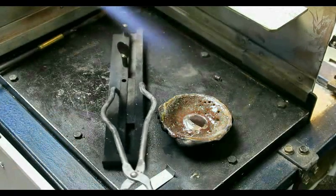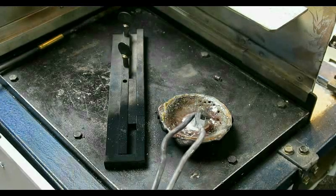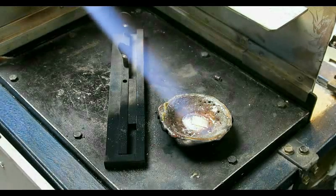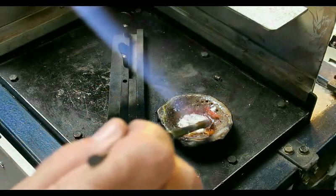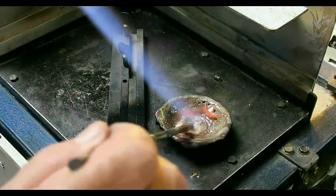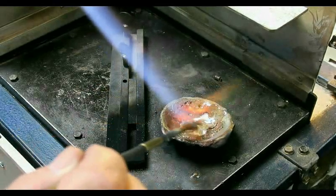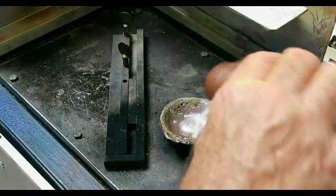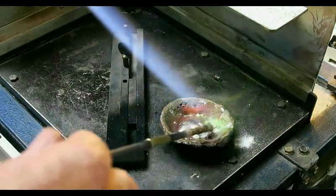Never overheating it — just keeping it to the point where it doesn't start burning. Then the final piece of zinc goes in, and again a good thorough melt, stirring it nicely. Then I put in some more boric acid just as a final antioxidant.